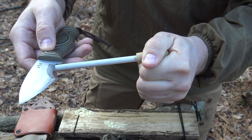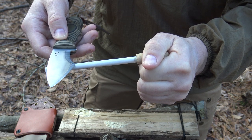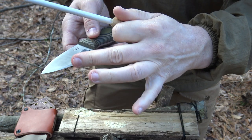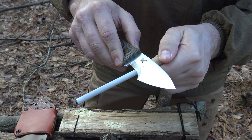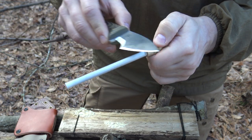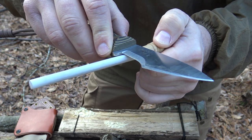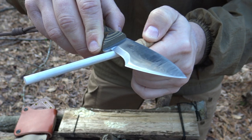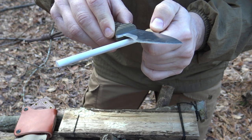Once it mates, I don't have to sharpen this blade in two stages. I can go right past that little tooth — that little hook area — and keep right on going. Because it's the same angle, it's easy to pass right by that little tooth and maintain your angle. On the other side I can't see as well since it's going away from me, but I can feel it. I tilt and feel when the two mate together, and just maintain that angle.